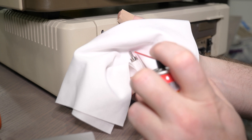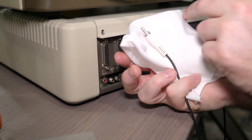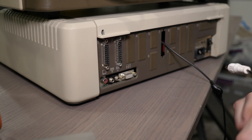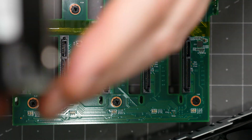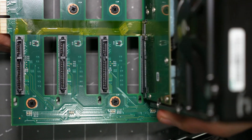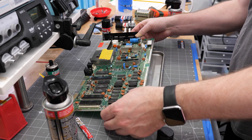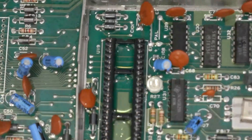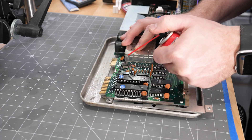In general, applying Deoxit is straightforward: unpower the device, spray a small amount on the conductor, connect it, and then lightly spray again. For me, this method works well as a maintenance step — it has fixed crackling audio and fuzzy video on RCA jacks. A unique property of Deoxit is that it will migrate to other metal surfaces, so this method also works well for connectors where you cannot easily reach both sides. Direct application is better, but indirect is still a good option. The one mistake I had been making for a long time is applying too much — the 142-gram can sprays way too much for most small-scale electronics applications. Once the solvent and propellant dry, the remaining material won't cause short circuits, but it is wasteful. So it is better to apply small amounts in short bursts, and when using any of the 100% concentration types, you should wipe off the excess.